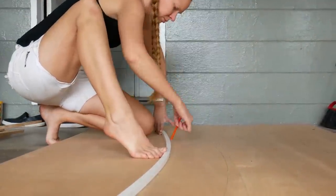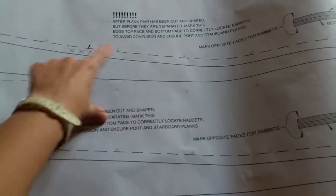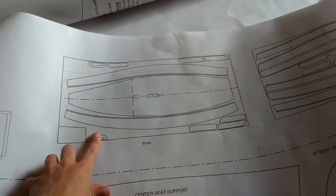Let me show you this, though. Again, we had those small plans with the Eastport Pram. Here, we have giant, full-size plans, including full-size planks. So, instead of drawing all those tiny little lines and connecting them with dots and hoping your measurements are correct, you literally just trace the full-size plans, which is pretty darn cool. And they have marks here for where you put all the holes for when you wire it together. Boy, isn't that nice. And check out the use of plywood here. Quite efficient.